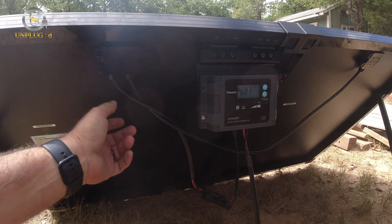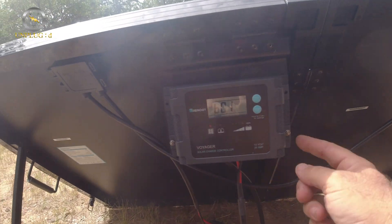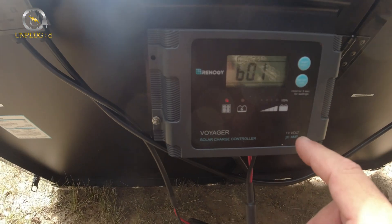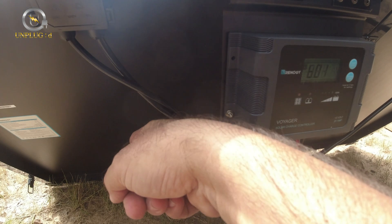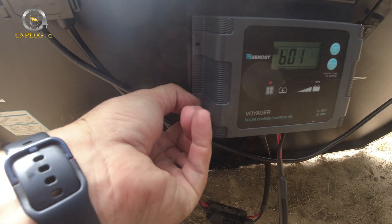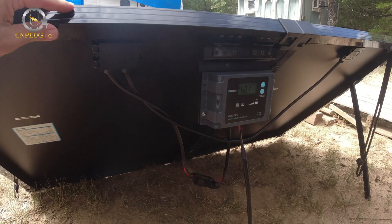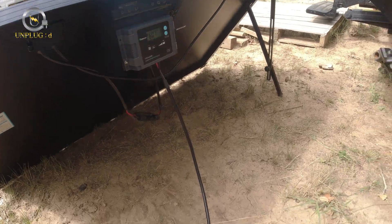I'm not plugging into the Solar on the Side today, and I'll explain why in a second. Now the one thing I don't like about it: it came with these small nuts and bolts right here, and when I got it, three of them had fallen out so the controller was hanging off. I found the screws in the bottom of the plate and put them back on, but one is falling out again. These screws don't have lock washers or locking mechanisms, so you're probably going to want to replace those screws so the controller isn't flopping around — just an FYI.